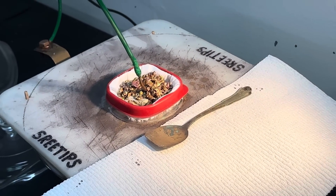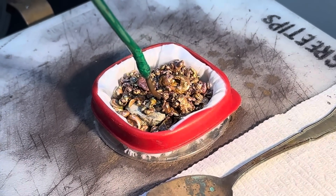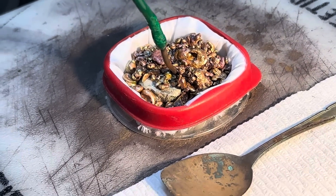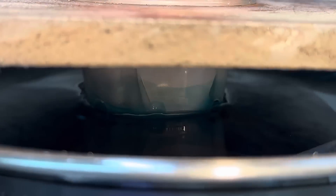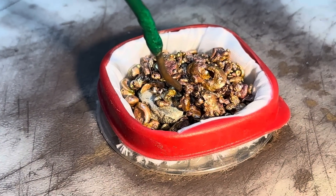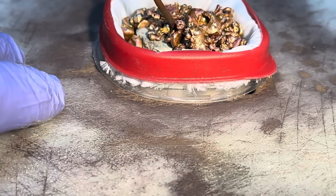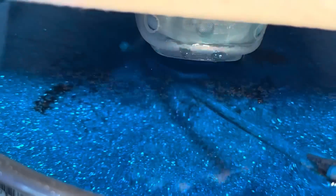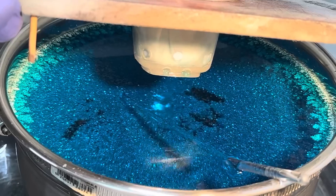One more time, let's review this real quick. The positive side of the power supply is connected to that anode electrode bar that's buried in the impure silver in that filter. The current flow causes the silver in contact and submerged in the electrolyte — it's got some holes drilled in it — to dissolve. Insoluble material gets trapped in the filter, and the silver ions that dissolve from that impure silver travel down through the electrolyte and plate out on the inside of the stainless steel bowl.